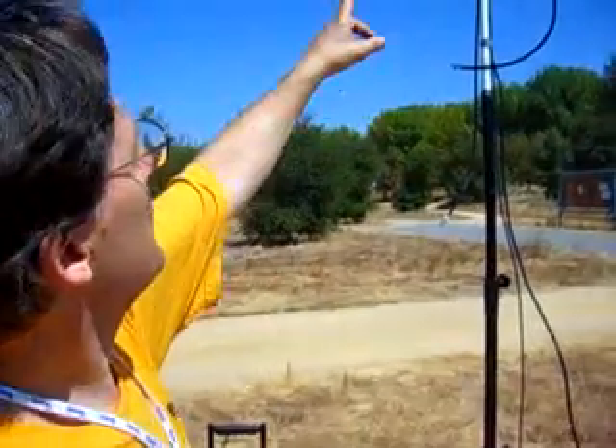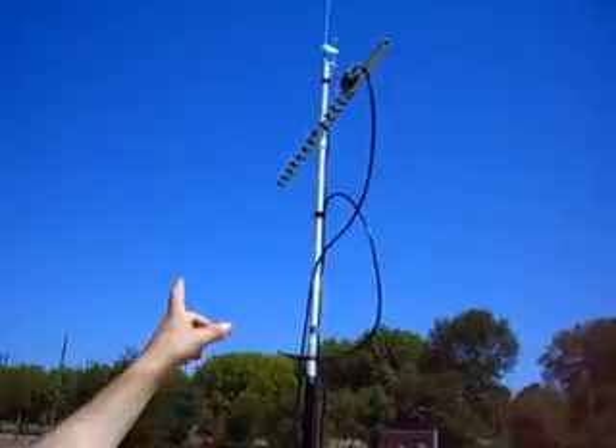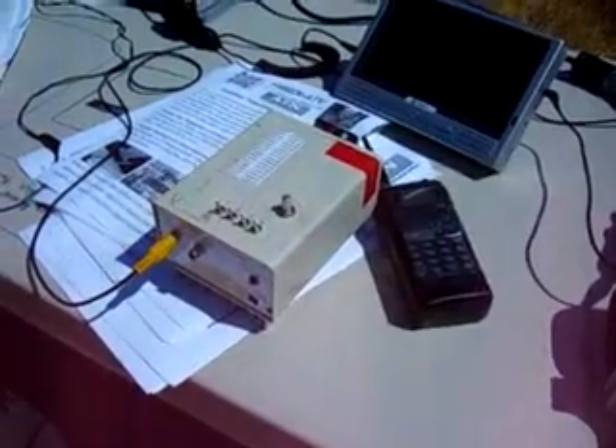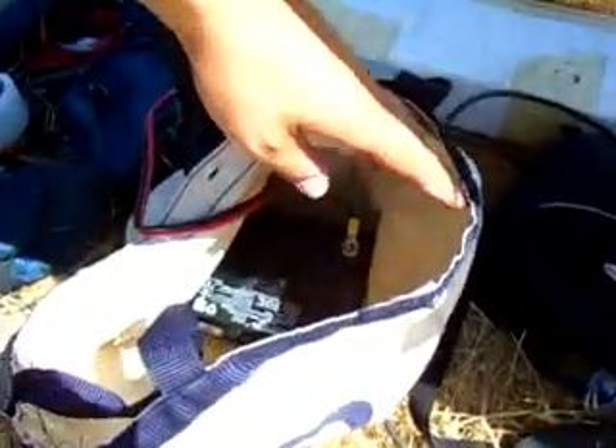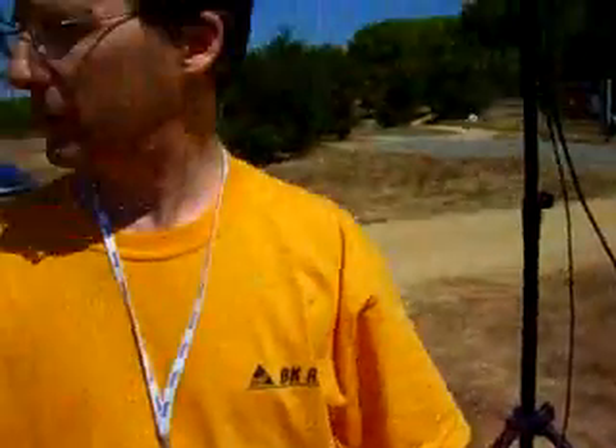They do make an omnidirectional antenna. The reason I use this directional antenna for my uplink is that I'm only using 2 watts from here. I can go with more wattage, but then I use up my battery power. This whole station operates off this gel cell right here, so I'm completely independent of whatever infrastructure you have. You could go solar on a day like this — well, not really, you'd need a lot of solar panels.